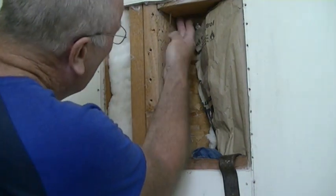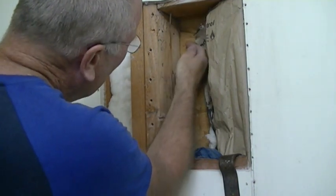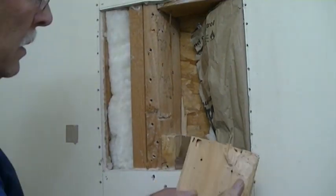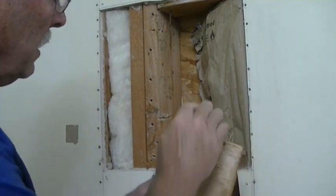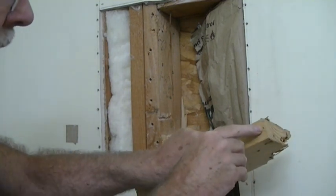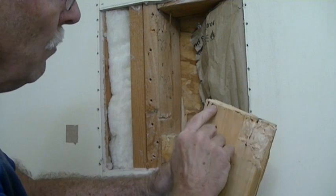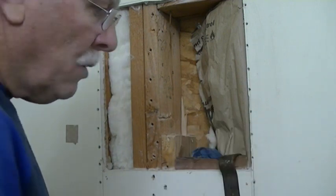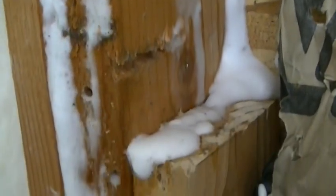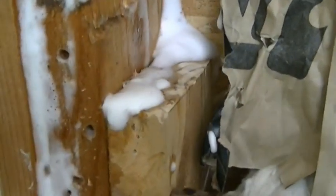Now I want to see if the bottom plate is nice and clean. It looks like they came in right there into this piece — not from the top plate, which is nice and clean. That little hole right there is the entry hole, and they ate that out and started working their way through to make a nesting area. I went ahead and treated it with more foam termiticide, getting all the crevices and cracks in between, just to make sure anything left over will be dead. I'll let that cure for a day and then come back to put the new piece in.